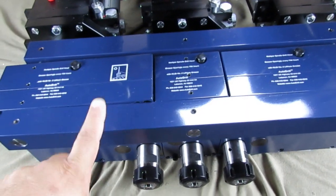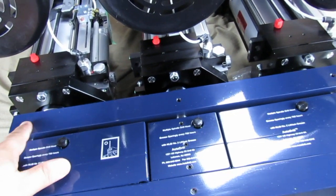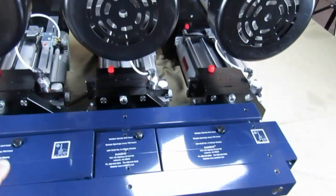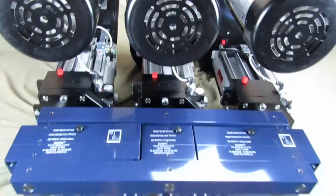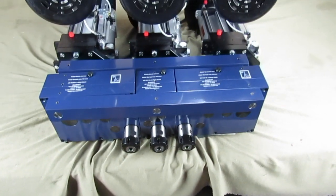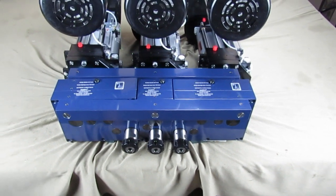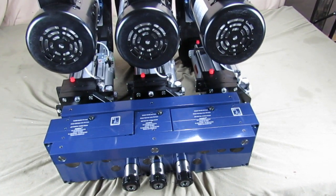They can insert this bar, which has guide rods that go directly through the head into the bar, and lock them in place. Because it can't rotate on the quill and this bar keeps everything from moving apart, the heads will be stabilized. It's not nearly as good as drill bushings, but it does give them a level of stabilization above what they'd have with nothing at all.